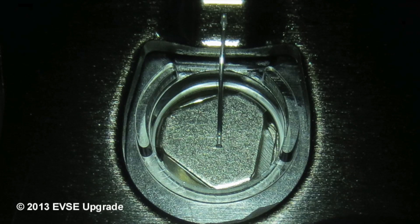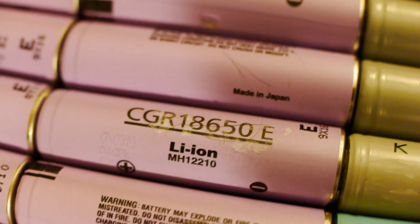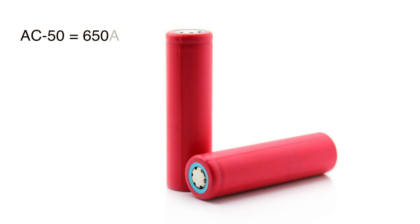Looking at leaked Tesla battery pack pictures found online, it looks like they used a very simple low-tech wire fuse on each cell. I just need to test wires of different diameters until I find the one that blows at the desired current level. To find the desired current level, first I have to figure out what's the maximum amperage each cell will see under normal use. You take your EV system's maximum power consumption — in my case 650A — then divide that by the number of parallel cells in your battery pack. My design will have 150 cells per module, so each cell will see a maximum of 4.33 amps. So the wire fuse has to be able to handle 4 to 5 amps. Let's test some wire.